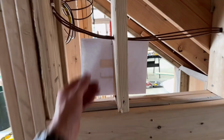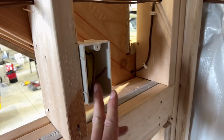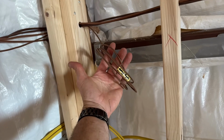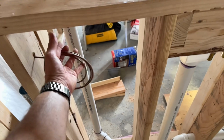And then here's your low voltage wires. So these are all low volt. They run in different holes than your high volt. And I put in low voltage lighting a lot of the time. So I run my 18-4 for an overhead LED bar. I run my 18-4 for a glycol pump for my boiler, which will go over there. And I run my 18-4 for my toilet flusher because it's one of those sensored ones that fires on its own, and it has to have 12 volt.